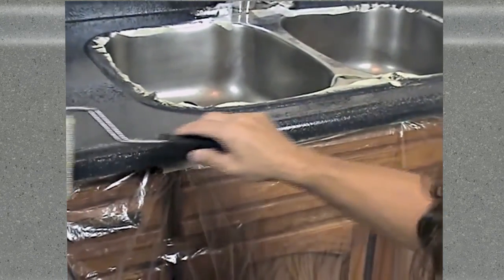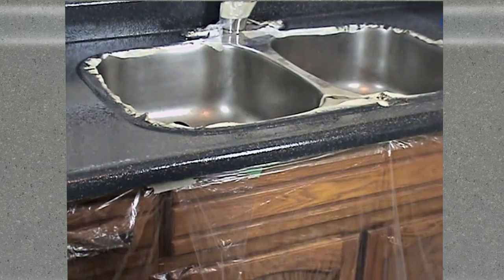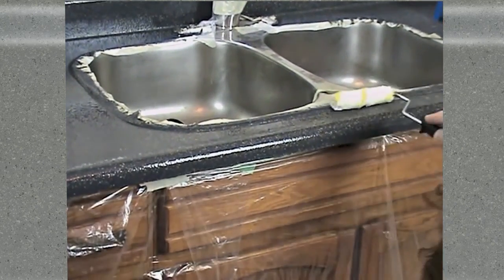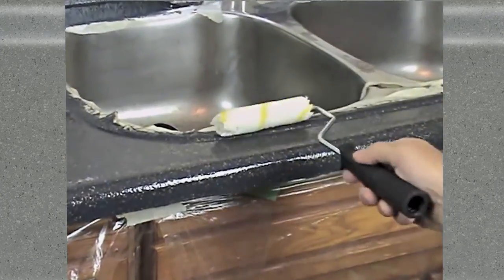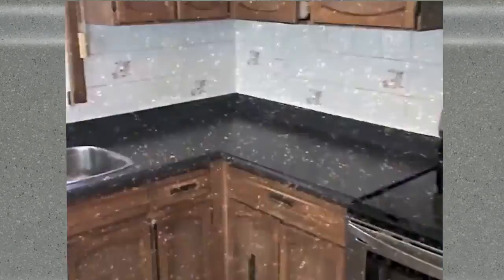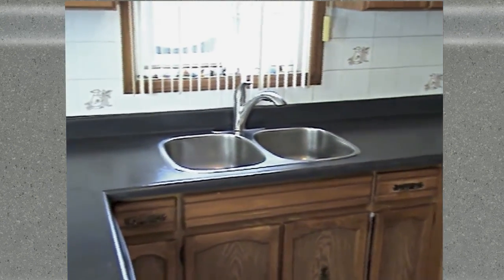After about 4 hours, apply a second uniform coat in exactly the same manner. Once your second clear coat has been applied, the job is done. Let the clear coat cure for 24 hours and maintain light use for the first 7 days. When the clear coat is applied, the brilliance of your new countertop finish will come to life before your eyes, and the lightly textured surface will be further protected beneath a tough, clear shield.